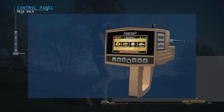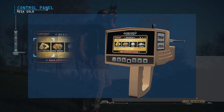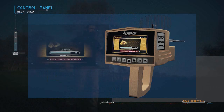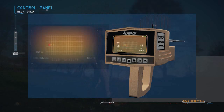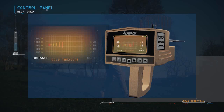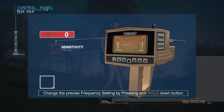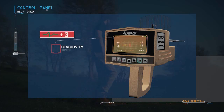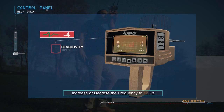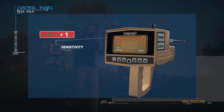After selecting the language from the language menu, the targets menu will appear. The user can select the appropriate target by pressing the enter button. After selecting the target, the program loading screen will appear. The Long Range Locating Screen will show the name of the chosen program along with a table of distances and depths. You can switch between distances and depths using the up and down buttons. You can change the precise frequency setting by pressing and holding the down button until hearing a different tone, then changing the value with the right and left buttons. The user can increase or decrease the frequency up to 12 Hz, with an increment rate of 1 Hz per press. It is preferable to leave the precise frequency on the factory default at zero.